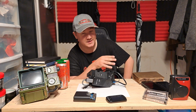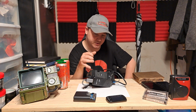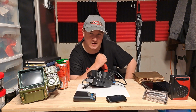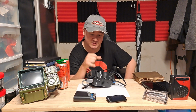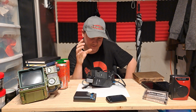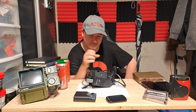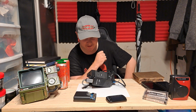Even if it's 2 amps, same voltage, it will not boot. You gotta remember that this thing is a full-blown computer. And this computer is pushing a display as well. If it's running on 3 amps, connected to this USB dongle, it will push this display and everything in it fine. But if it's not connected to 3 amps, it will not even turn on regardless of what's plugged into it. If you can find one capable of supporting 4 amps, I would go for that one, just because then the computer has the additional power when it's needed.